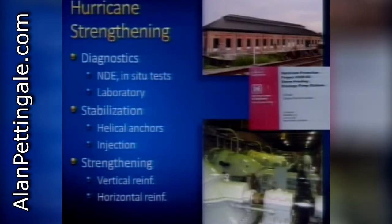Let's look at a quick case study for hurricane strengthening - a project we're just wrapping up on a whole series of pump stations in New Orleans. New Orleans is below sea level; every time it rains, canal systems collect water and massive pumps lift that water into other canals that drain into Lake Pontchartrain. We worked on 17 of these buildings. After Katrina, the Corps of Engineers realized they were very close to losing some pump stations due to inadequacies of the historic masonry in resisting hurricane-level loads.